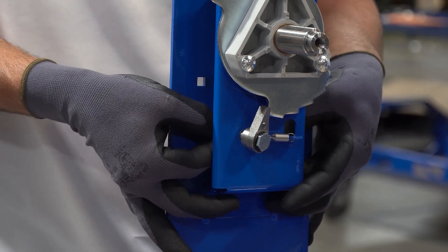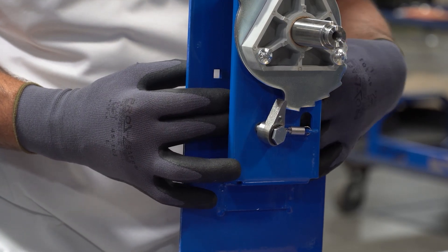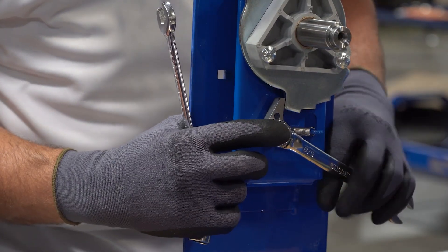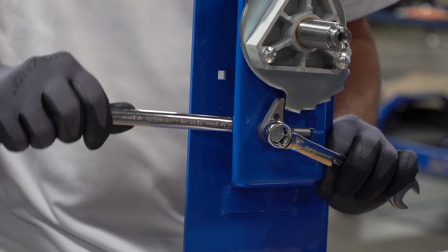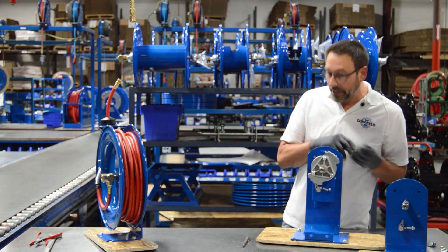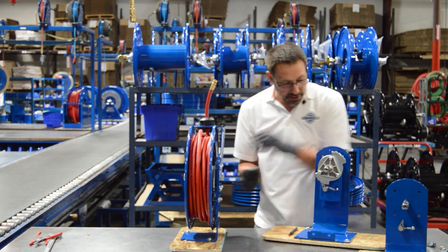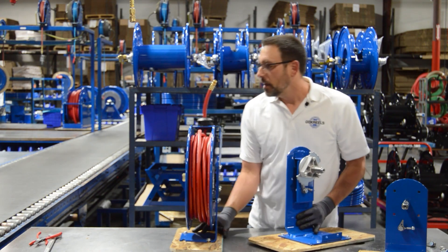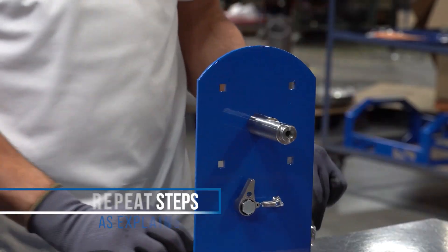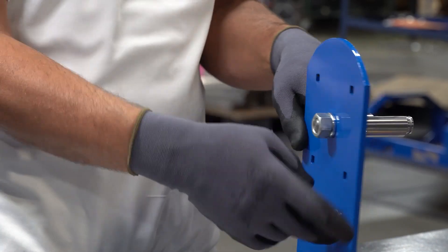Put the lock washer on and then the nut. Hold it in place, tighten it down, put the wrench on and torque it down — and we're back in action. The reel is fixed. Now let's take a look at it on the P-Series. Like I said, it's a little harder because the P-Series has much less room to work with since you don't have the super hub space. But because it doesn't have the super hub, the nut is just on the back side, so it's a little easier that way. The process is the same.